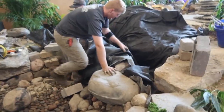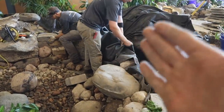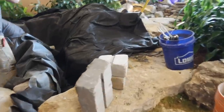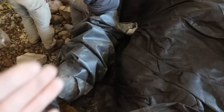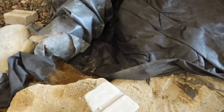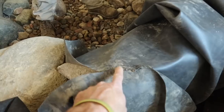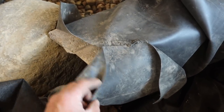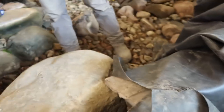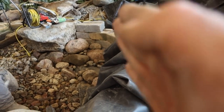We've got the top course on. You can see Jack over here pulling the liner up. They're going to start moving sand back behind that liner to hold it up and fill the void space through here. It's super important that we try to eliminate as many folds as possible when working our way in through here so that liner stays up nice and vertical. Another area of concern is right here where the seam runs and connects the two liners — you can see two liners and a little bit of the tape.